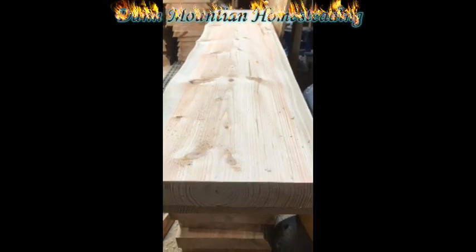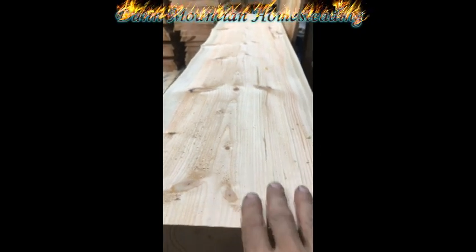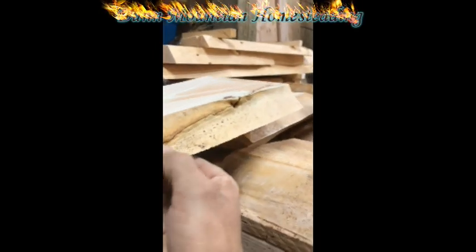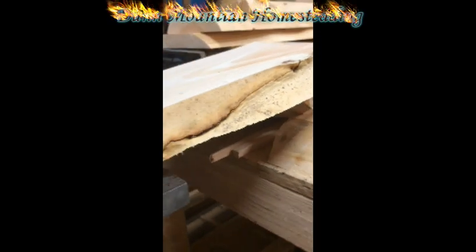Here's an interesting observation. This board here, how we cut it, is in the middle of the board, and our lines are up and down, versus the one below it, they've got the arch. If I'm understanding, this board here has a different character, but it's not gonna warp as much. It'll be straighter. This board here has a lot more tendency of warping, bowing, and having cupping issues. And this one got cool live edge, but it's in a split. So I'm gonna have to take this off possibly and see if I can glue it on there and try to strengthen that seam to keep the live edge look, because it's got a cool ripple where it was splitting.